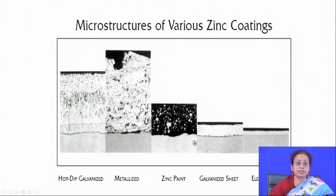For galvanizing for utilities and furniture purposes, cladding operation can be used. For long structures like bridges, painting or thermal spraying is applicable. For batch components of medium size dimensions, hot dipping by continuous processing is preferred. It is important that you choose the proper coating technique and proper parameters to achieve the desired properties in the coated product.